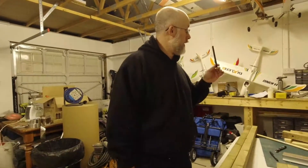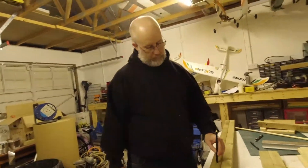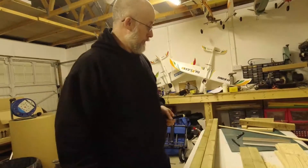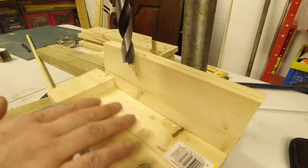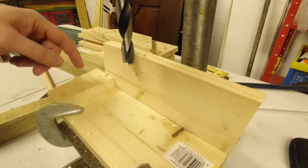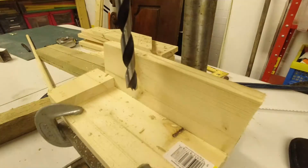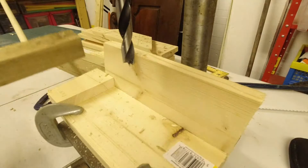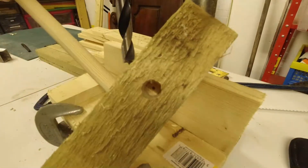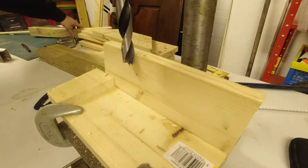What we're going to do now is set up the jig that I've made with the pillar drill and do some test drilling. We just want to get the depth right so we only go so far, and get the angle right and just get it all positioned. The jig's all set up. The top of the piece of wood is going to be this end, so we get an angle that way on the piece of upright. The depth has been set so that the bottom stop is as far as we want to go. I've done a test piece just to make sure it all works. What we need now is the actual pieces of wood to do some drilling.